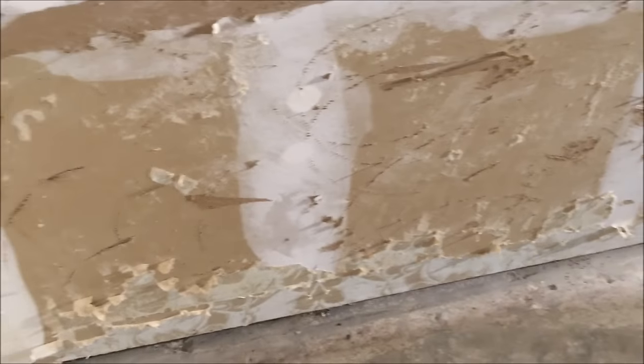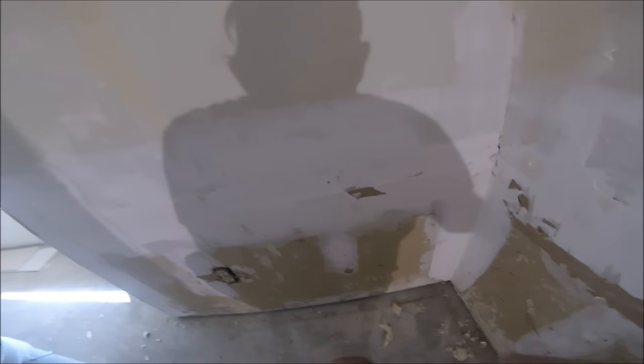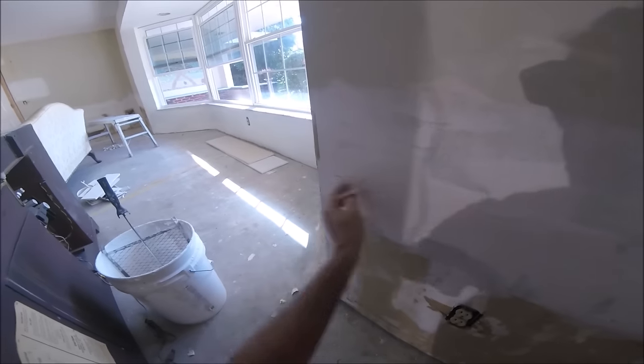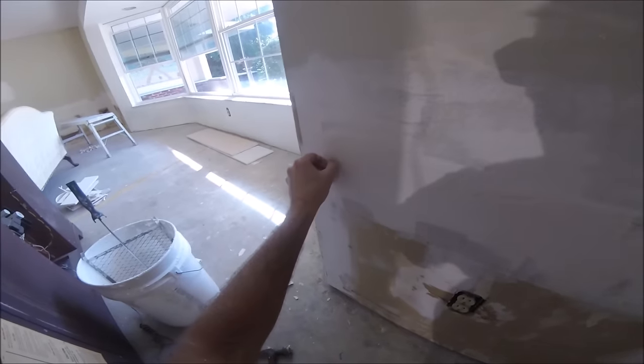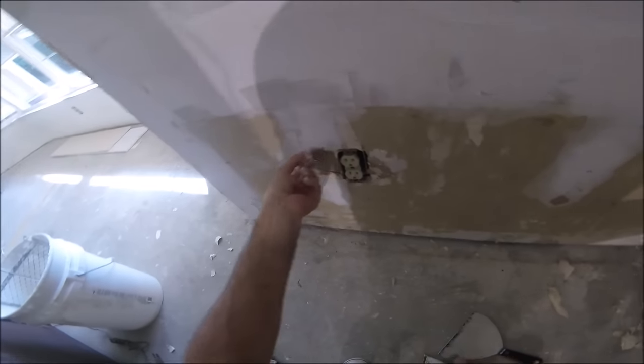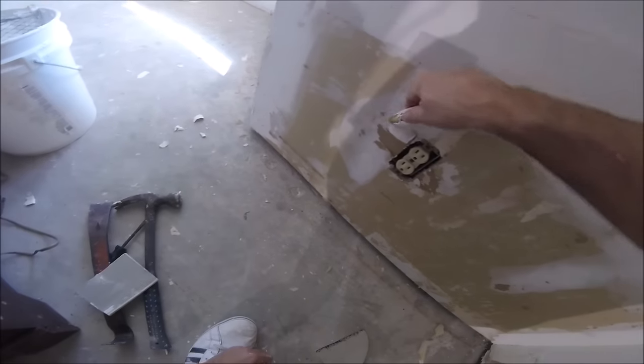The walls are completely gouged up and the torn brown drywall paper can be a problem. I'm going to show you the exact product you need to use to seal it up. But first, you need to cut away any blistered or bubbled areas and remove any little pieces of the wallpaper that you can. You'll also need a razor knife and a 6-inch drywall taping knife to do any scraping.